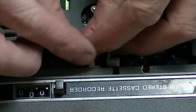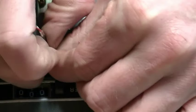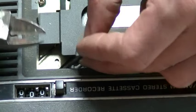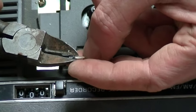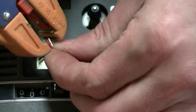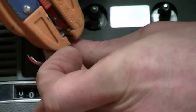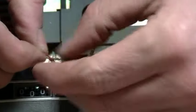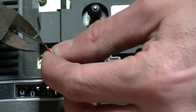Once you've located the wires, it's time to trim them up a little. Around each one there was a clear plastic tube — I just removed that so I could get to the wires a bit easier. You haven't got much to work with, so take your time. You don't want to trim any of these too short. Once you've removed that plastic, pull the insulation off the wires so you can start tinning them. Take your time — there's not much to work with. Trim them and add some solder to the ends once done.